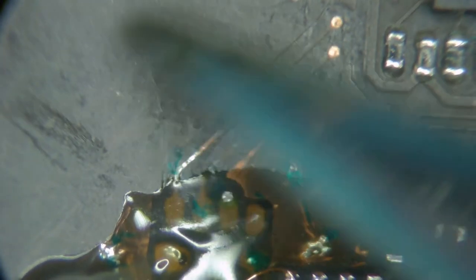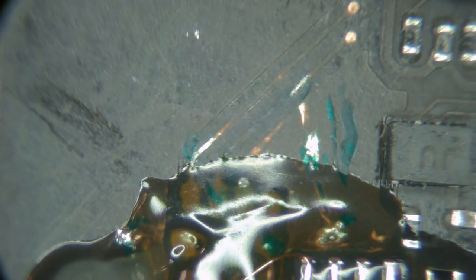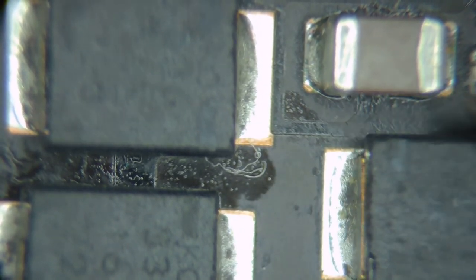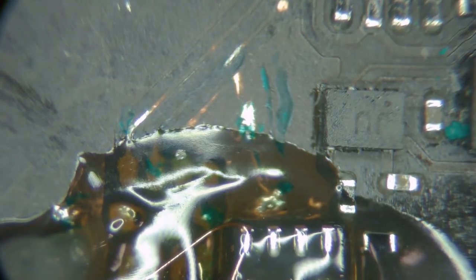So when we look at these, the first layer here, this is all copper underneath the solder masking. And usually you see something large like this and you say, oh, well, that's going to be a ground plane, so we can just hook up to this. Not all the time is something that's large and copper like that a ground plane. Because when we look over here, yeah, this is part of the ground plane, but then we have this large copper trace. This whole area right here is not ground. This is all some kind of power up here. And you'll find that all over the board, especially in areas like this, where it's separated by a couple traces that are running through it. This doesn't necessarily have to be ground, so you have to test it before you trust that that's ground.